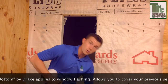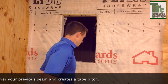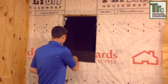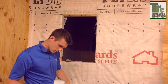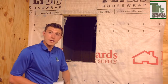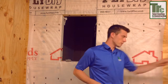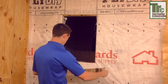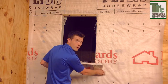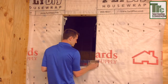Starting at the bottom is more of a roofing thing, but it applies to windows as well. Grab your blade, cut it. Some people will cut half the adhesive backing off and then do one section at a time. The first piece is always the most important. If you get a six or eight inch roll, it would be easier — we grabbed the four just based off the size of the window. We have it at three inches. We don't necessarily need to cover those 45-degree cuts right now; when we go back to put that aluminum tape over, that's when we'll cover them. We want to be at least two inches on the sill.